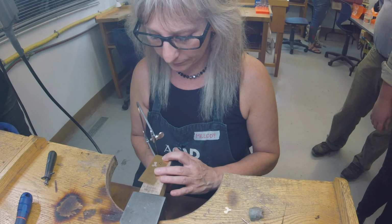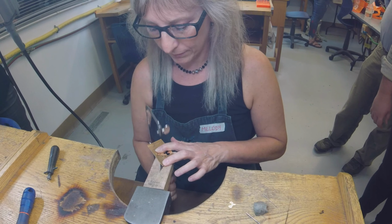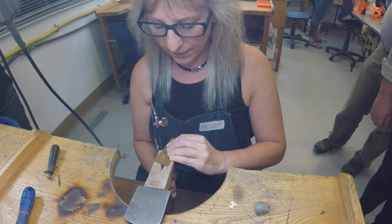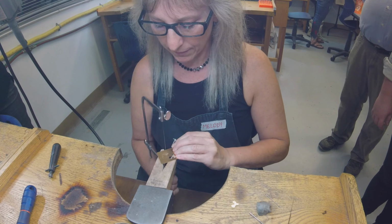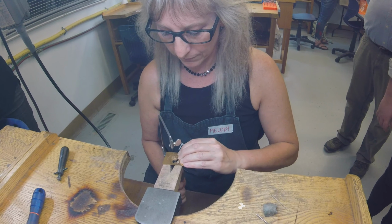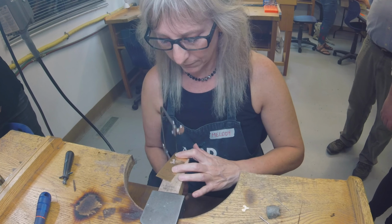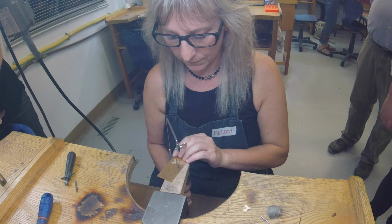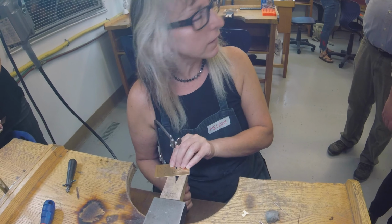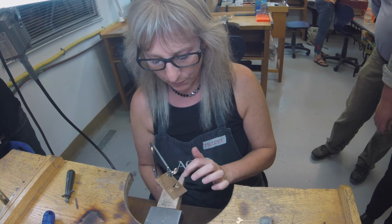So this will be like doing a zigzag. I'll just saw to the line and then start following the line. Once I'm at the corner, stay in one spot as I turn. If you get stuck, just back up a little. Make inlays for your wood using this technique. Yeah. And then I'm going to end off by having my shape supported by the wood.